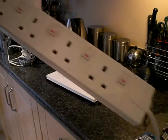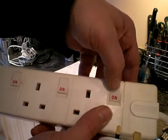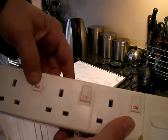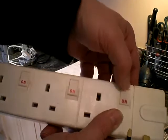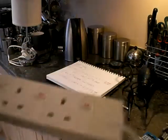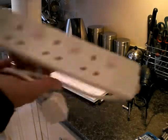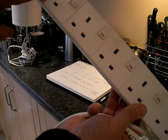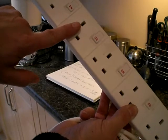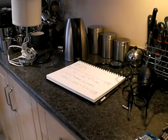And when you're not using individual ones — like say you've got a mobile phone charger in there — just switch them off when you're not using them, because it continues to draw electricity. So remember that: 13 amp fuse, 3,120 watts is the maximum you can put through it. And to calculate that, take whatever you've got plugged in and add them all together — a lamp at 60, a toaster at 2000, and other small appliances. Just don't go over 3,120.